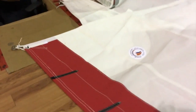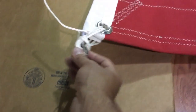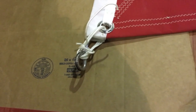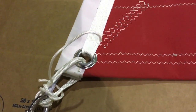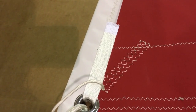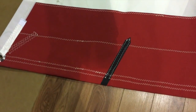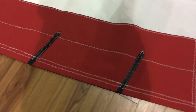We'll start down here at the tack so you can take a look at this wire luff. It's a bit unique for a 30-footer. Notice how we've got the wire luff running all the way up the luff inside the luff tape, and then it is secured so it doesn't flop around, using some nice tie there. Reinforcements in this tack done with webbing going vertically up the luff, and there are also some reinforcements underneath that Sunbrella. A nice little add-on is the hash marks here — when you're furling it in, you have an idea where you're going and where you've been.